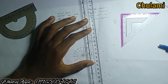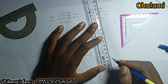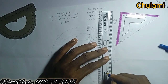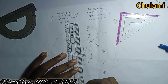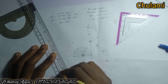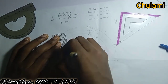With a radius of 10 millimeters (1 cm), pin at all those marked center points and draw circles. These represent the roller follower positions. By right, measure 1 cm and pin at each center point, drawing a circle with radius 10 (diameter 20). Do this for every point that was marked. Be careful — if the diameter given is 10, use the instrument directly as it already has diameter 10.